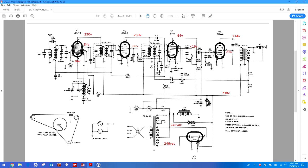The other two resistors, once I lifted the leg on the first one, started showing correct values. This other one meg measured about 1.6, so it had gone high - I replaced that with a 1.2 meg again, but it made no difference. I also changed a couple of yellow capacitors just to see, but that made no difference of course. There's a 47K resistor that looked a bit burnt, so I changed that too, but still no difference.